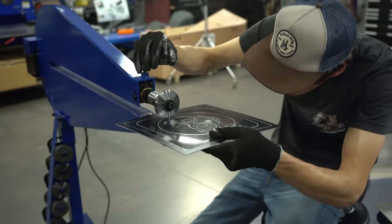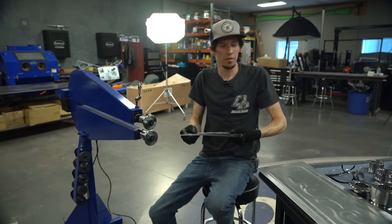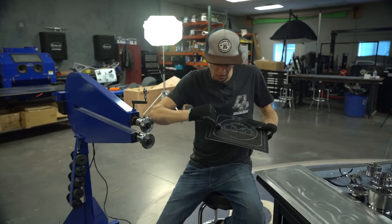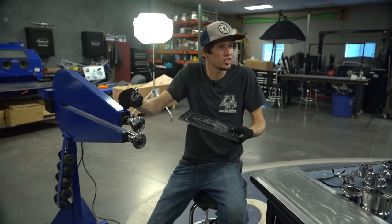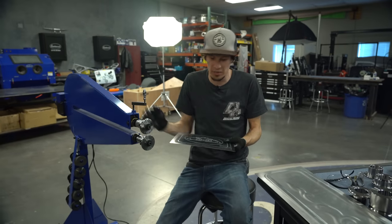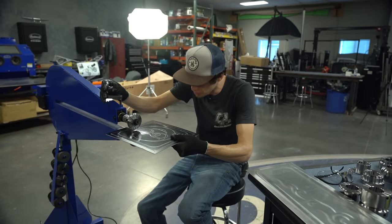Get over to the corners and fade it in. In tight corners, sometimes you gotta look at this as a bead roller and think 'how am I going to turn that?' Sometimes I'll literally just do ding ding ding ding ding — you know, to get that final little weird spot you can't turn into. You basically turn it into a little press and just hit that spot and then get out of there. If you're doing a face and the pupils are tiny, you might be able to cheat some of those spots and just work your way around it. At the end of the day you're working metal — use the tool how you see fit.